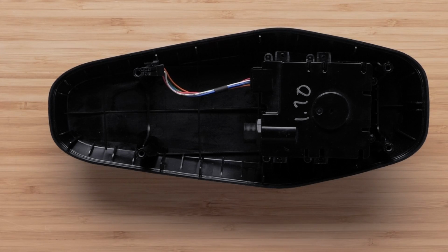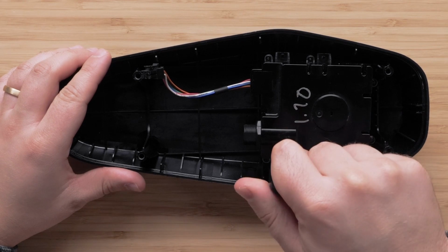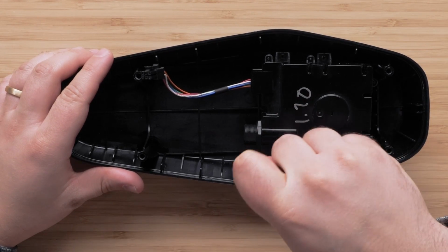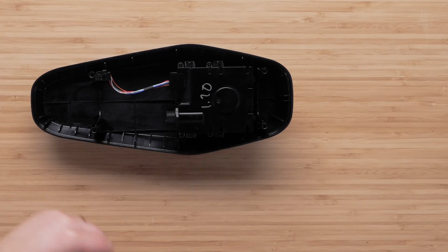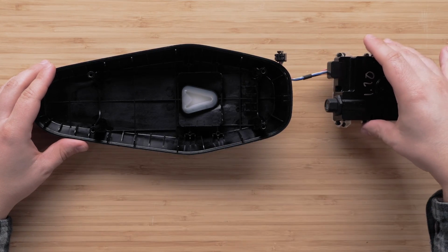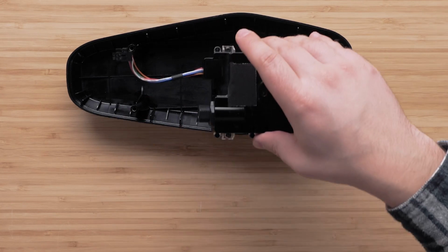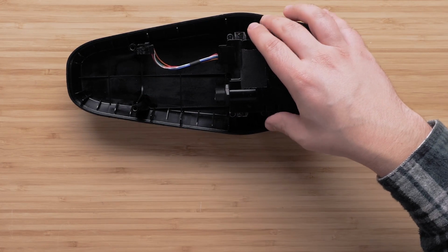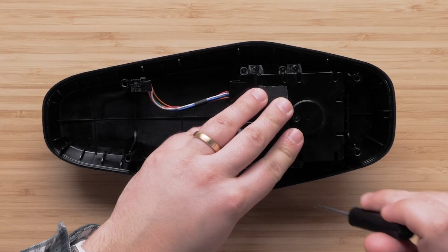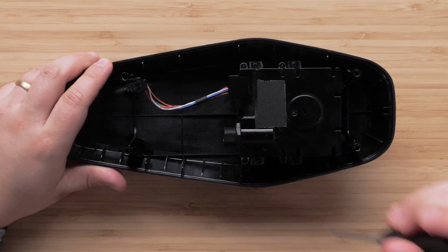If the top of the shaft cap is also being replaced, use a number 1 Phillips head screwdriver to remove the 4 screws holding the antenna to the top of the housing. Next, remove the antenna. Align the new antenna to the 4 holes on the top of the shaft cap. Reinsert and tighten the 4 screws using the number 1 Phillips head screwdriver to secure the new antenna.